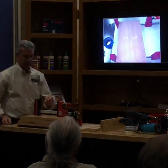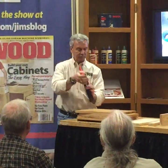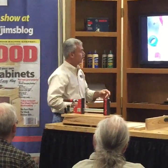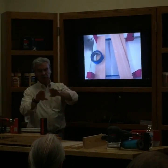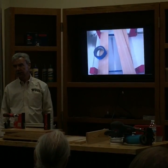One of the only drawbacks with these, other than the price, is that the little knurls on the top here are where the claws and this head grip as you tighten the clamp up. And if they get filled with glue, they just don't operate well at all. They either don't clamp really well or it's hard to slide them. So what I'll do on mine is use a little bit of painter's tape underneath the edges of where those seams go together, so the glue that does drop on there can peel off right away, okay?